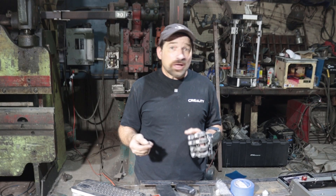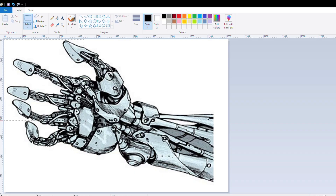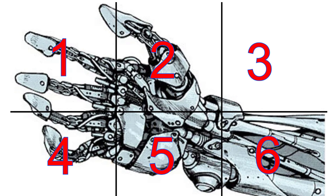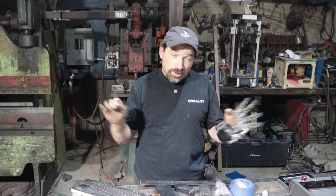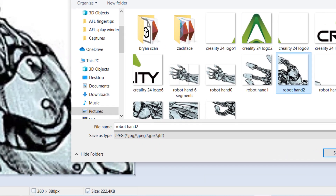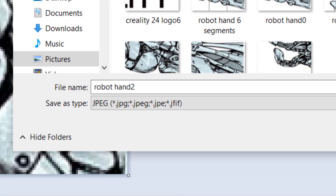If I'm working on an engraving project, which most of these projects are, I start by prepping the artwork using, of all things, Windows Paint. The first step is to crop the OD of your image to some multiple of 380 pixels. This image has an OD of 1140 by 760, which makes six panels of 380 square — three across, two high. I carefully crop the image into panels 380 by 380 and save each panel with a number that correlates the position of that panel within the artwork as a whole.